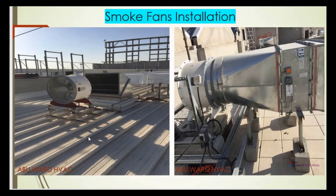This slide shows the smoke fan with the duct, and after completing the installation, the plenum and motorized damper connect to the duct coming inside. This system will be connected to the control panel, to the fire alarm, and to the BMS.